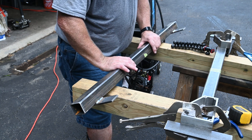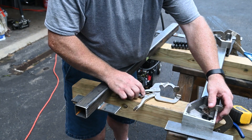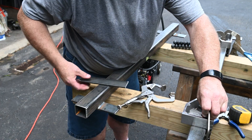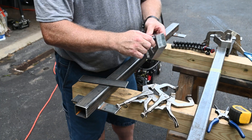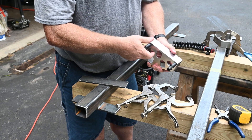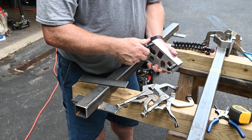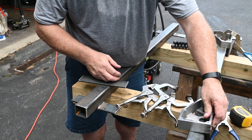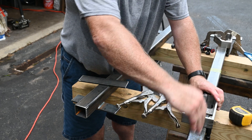I have three more of these to do today. What I've found really handy are these fabrication squares from Fireball Tool. They come with these — or these are accessories — these are edge alignment pins. You just screw them into the bottom, and now you can use the edge to line up the square basically in any location, and this will be perpendicular to this axis.